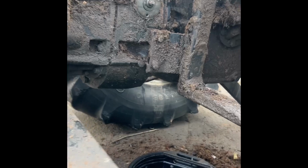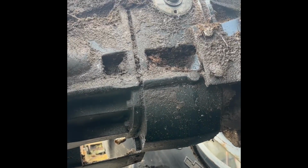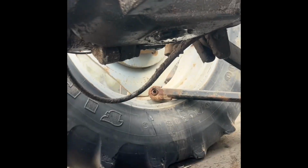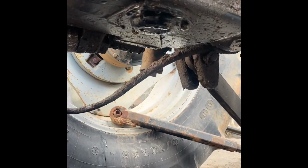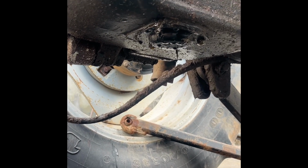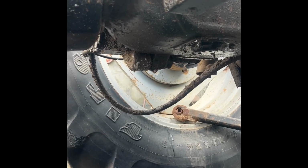Lovely. Okay, after yesterday's debacle, we're back here this morning. We're going to take off the gearbox, but first take off the filter cap underneath and let any remaining oil drain down there. So then open the ring of studs. We'll take these bottom ones out of the way, and then we can move the axle stand / gearbox housing back to this point here.